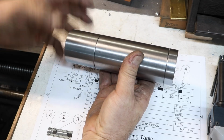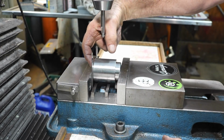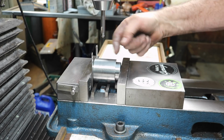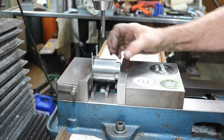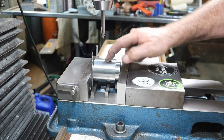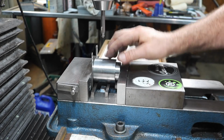So we've just got to punch a hole in there, and then this is already pretty much ready to install here. So I have shims here, 51 thousandths on each side, so that the drawbar plug is not flush. And then I have a small adjustable parallel down in there, you can see, to take up this space, so we're clamping it tight against here and against the outer part, against those shims, against the back, the fixed jaw. And I'm sitting on some 1/2 inch high parallels.